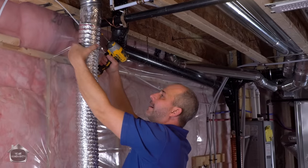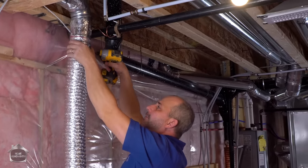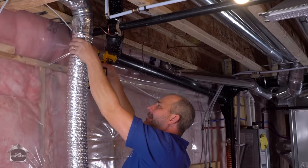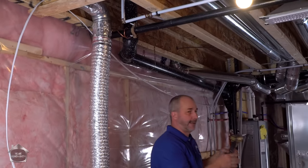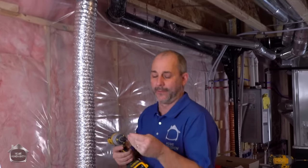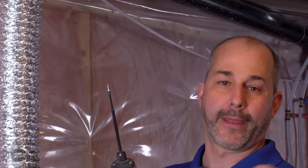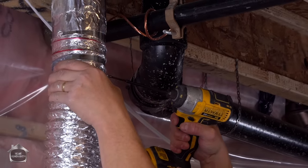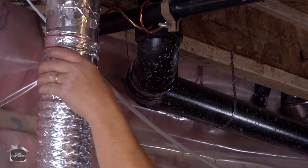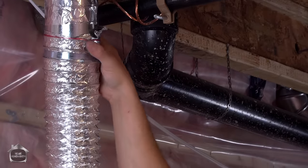Now that we've got this up here, we'll take our gear clamp and slide it up. I like to make sure you tighten it down about two rounds. If you have them around, take one of these little self-tapping screws — you buy them in the little section of the hardware store where they have all the ductwork — and run it just underneath that gear clamp. That will pinch it in place so that it can't slide off or be tugged off over time, and you can be confident it's always going to stay there.